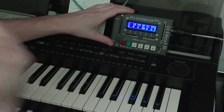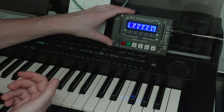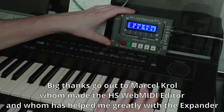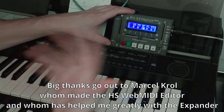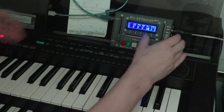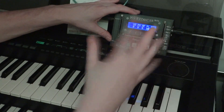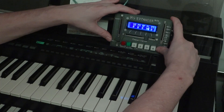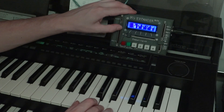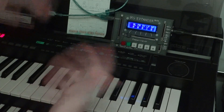Unfortunately, there are no real documents on the SysEx data provided by Yamaha. This is all reverse engineering and guesswork, both by people before me and myself. So aftertouch is still a bit of a question mark. We also have portamento level and portamento time, which is for the lead glide — which sort of works but still requires more research. The next category is voice. We can change the algorithm, which currently doesn't do anything because we only have operator one with a sine wave.